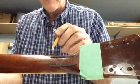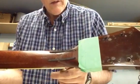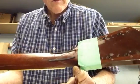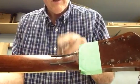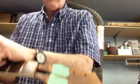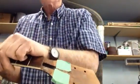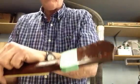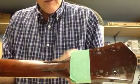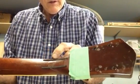So you've only got that distance to here. And then there's the big truss rod cavity, right? So you have very little actual wood contact here. So I thought, well, I'm going to spline it. Then I was debating whether or not I was really going to do any good with splining, because I'm only contacting a short portion of that.